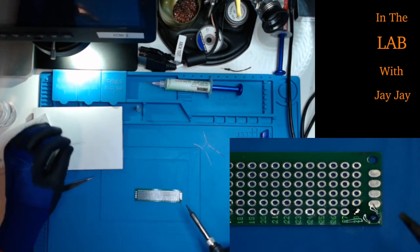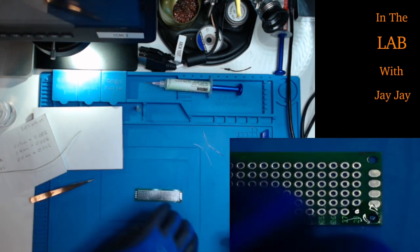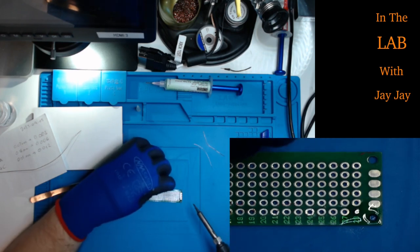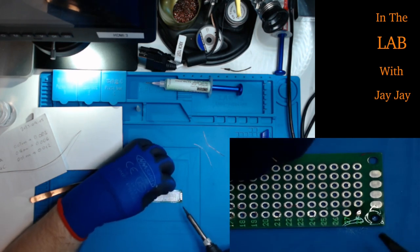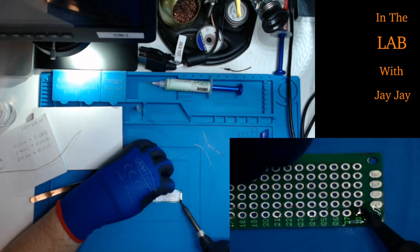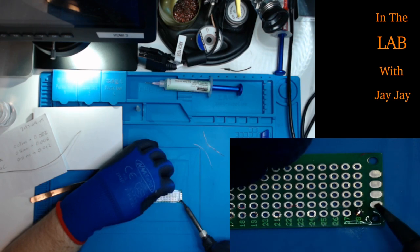I'm going to load that guy up with solder. And then we're going to start with our small bodge wire. So this is the 0.07 millimeters, which is 0.003 inches. It is tiny. So we just got to melt the enamel off the end of it so that it sticks into our solder. So that's just burning away there now.